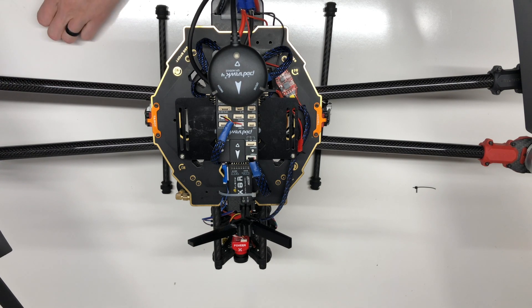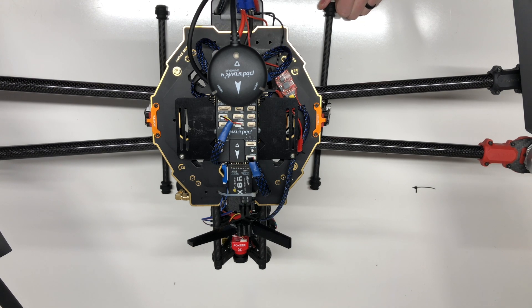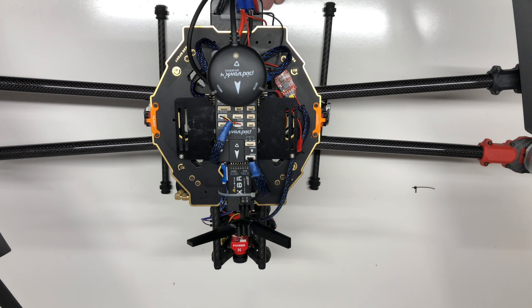We're back here on the bench after our successful auto-tuning session. It took about 14 to 16 minutes. Every drone might be different — I've auto-tuned three or four drones now and it seems to always take anywhere between 10 to 15 minutes depending on your configuration. Make sure it's a really still day with no wind, and make sure you're in a very big open area because it does tend to drift.